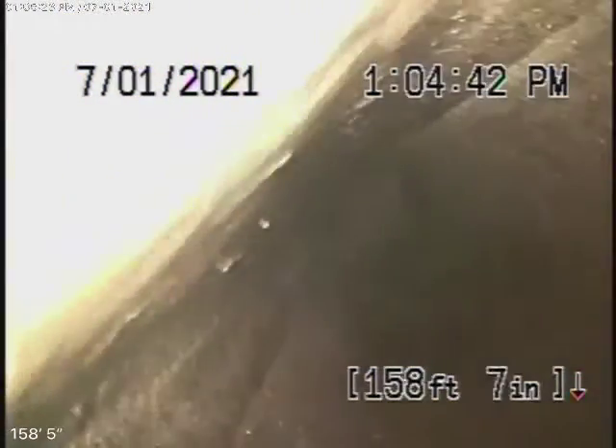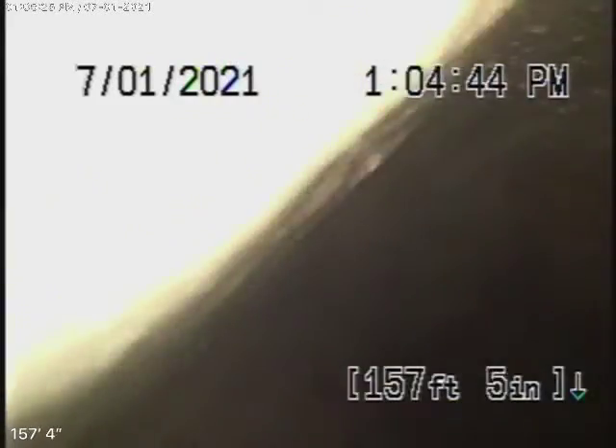Right now we're all the way out to the city connection — there's the city sewer right there. We're going to pull the camera back. Remember, we cannot check every pipe in the house; we're checking the main sewer line. We'll have your general inspector run the water everywhere to make sure everything's draining. Looks like we have a six-inch clay pipe coming back from the middle of the street towards the property.